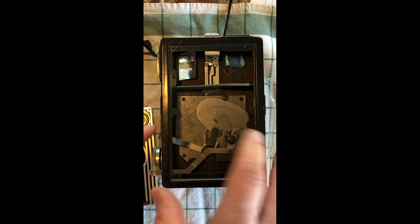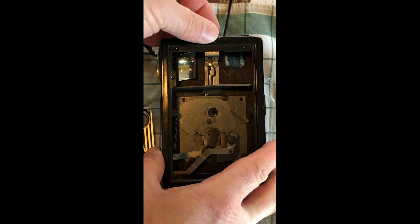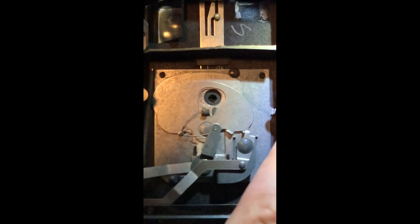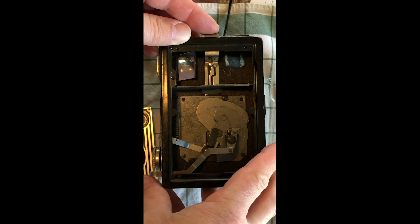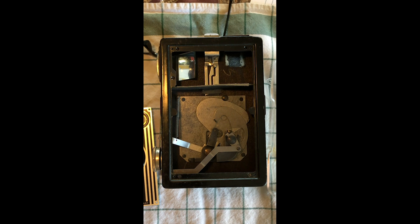In the bulb mode, you can see the effect of the aperture — it's just a metal tab that has two different sized holes in it. There's a smaller aperture and there's a larger aperture. When you let go, that closes the shutter. Just a fascinating mechanism. I thought I would share that while I had it open for cleaning, because I'm not likely to open it again. And there you go — we're going to put it back together.